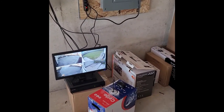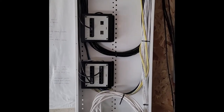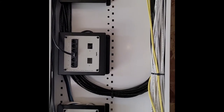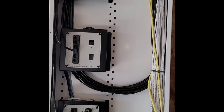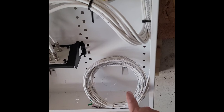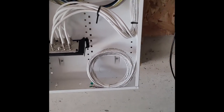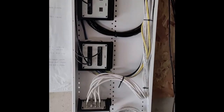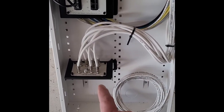Just a brief overview — the house isn't finished yet, he doesn't have the rack or the shelf, so I've just got his camera system up and going sitting on the floor for now, but there'll be a rack installed here later. Every outlet had two wires go into it, so every room has two jacks. That'll give him the ability to add an HDMI matrix switcher later and control video from his phone — say he wants to watch a movie in a specific room and send it there. This is the speakers for the whole house wiring. We're just waiting for the customer to get the rest of the equipment — the rack, the receiver, everything else. Hopefully Comcast doesn't come in here and screw up all my beautiful work.